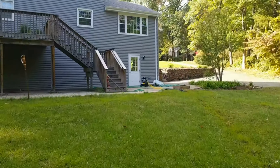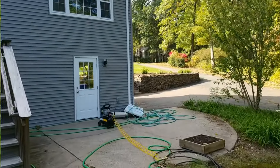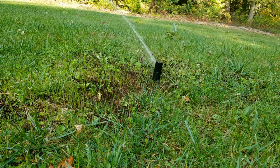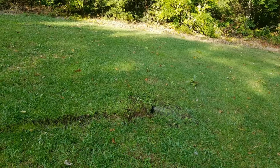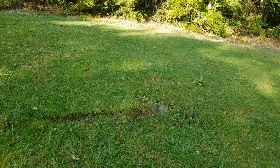It's looking good — I'll pull the pressure back down and move on to the other three, then come back to that one. This one is actually spinning around in circles. That's just at 30 PSI, nothing crazy. I'll let this go for a minute and go through the rest, then cycle back through. It is important to go through each sprinkler a second time to make sure anything blown down has been blown out. Then you're good to go for the winter.